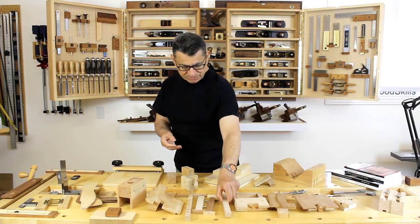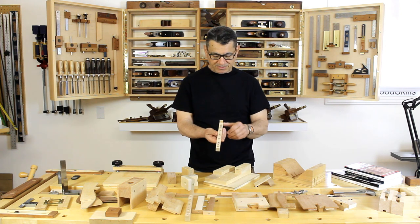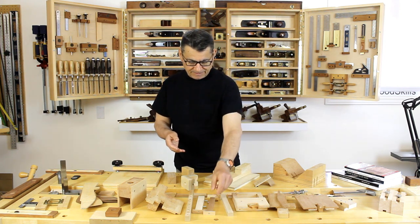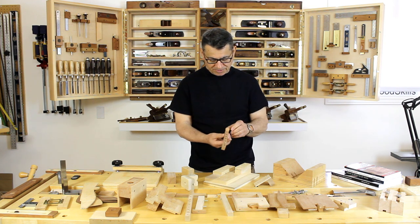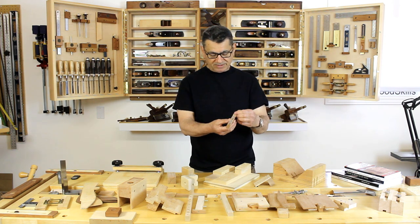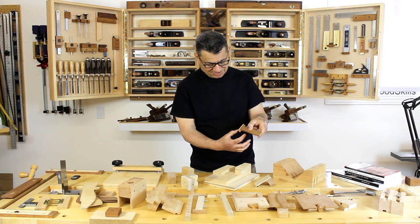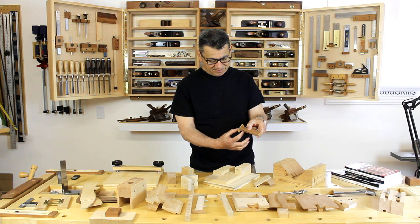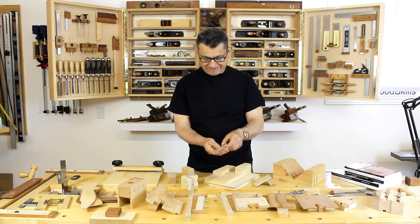There's a smaller one, designed for a specific length or depth of a cabinet. And there's another one for a shorter cabinet. The depth would be shorter, so again they're all reversible, so this part indexes to the cabinet side, and then this part indexes to the cabinet top and bottom, and everything flips over. Even the screws are mortised in differently.